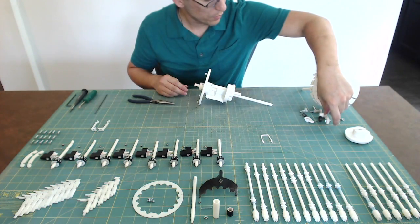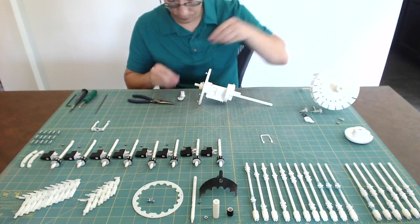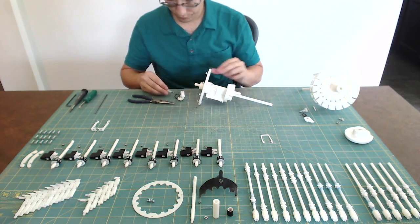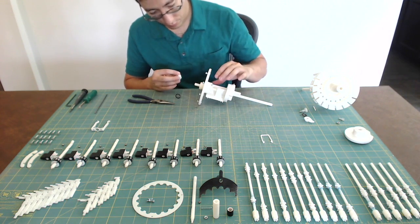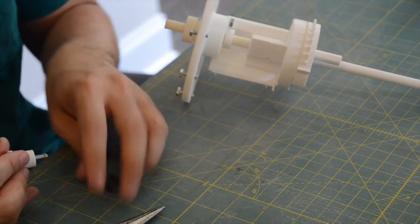The zero positioning lever is added next. Insert the bolt into its sleeve, making it a shoulder bolt. Insert the shoulder bolt into the lever. The roller should be fastened onto the other end of the lever with an M5 bolt and nut. Slide the zero positioning lever spring onto the lever with its leg in the middle hole.